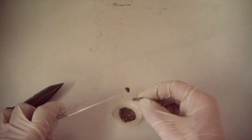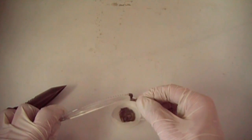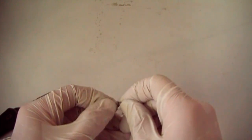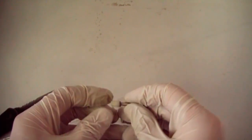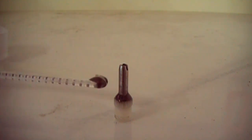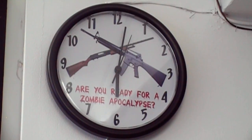Now I mix up some epoxy to glue the steel probe into the plastic piece from the lighter. Insert the probe notch-side out into the plastic piece about one eighth of an inch. A generous bead is added here because the piece will see firm downward force. Now follow your manufacturer's recommendations for curing time before putting the part to use.